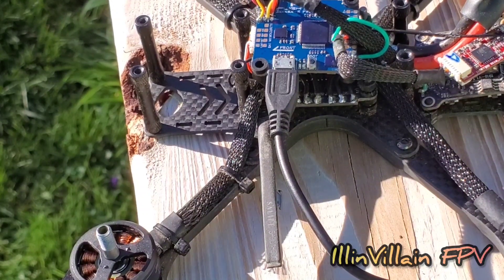That's it. Just let it dry and put it back together. I hope this video was able to help some of you guys that have never done conformal coating before. Even after it is waterproofed, I do like to still rinse with isopropyl alcohol if I ever fly in the rain or get it muddy. It's just good added peace of mind. Everybody's got a little downtime right now, so why not go ahead and conformal coat your fleet — that's one less thing to worry about.